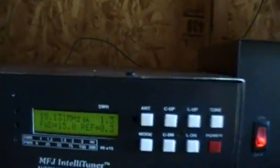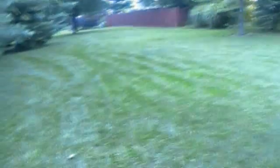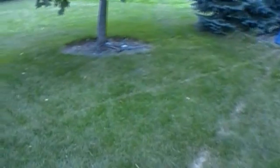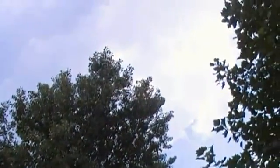As you can see I am on 18.131 with a 1.3 SWR. It tunes 6 meters through 160 just by applying 10 watts of power to the tuner. There's a little better shot of how it comes in — got a little bungee cord up there to keep the tension off the wire, and that wire runs to the top of the tree.